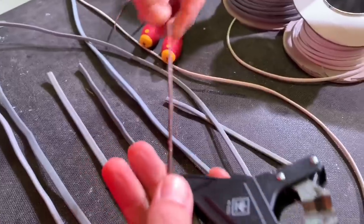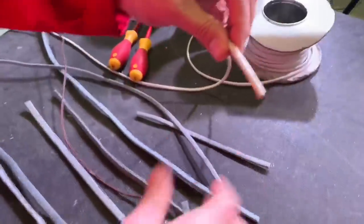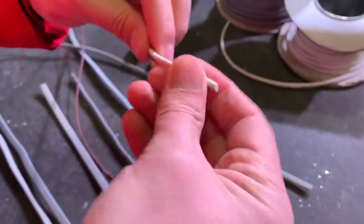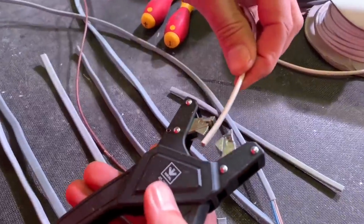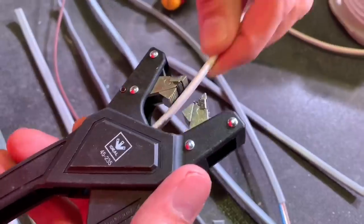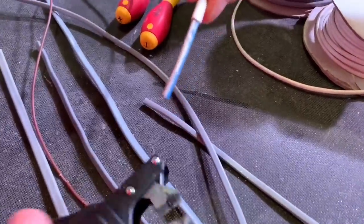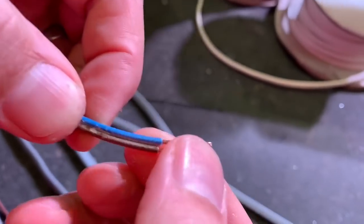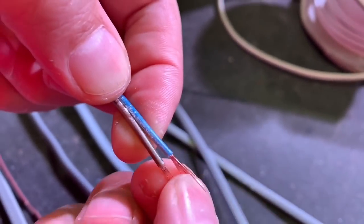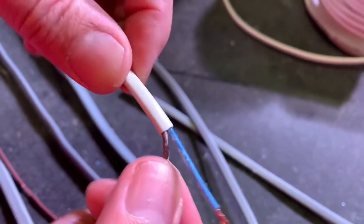Two-core flat flex — I think that's 0.75mm, the smallest it can handle. We haven't tried it on a round flex; this is a flat cable stripper. Put it in — wow. Inner conductors again, two at once. Let's go in close — always check to see if there's any damage at the conductor level. No, it's good, and there's not in the sheath either. That worked well.